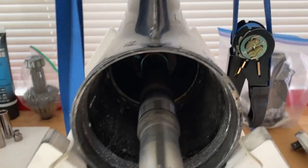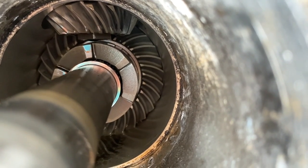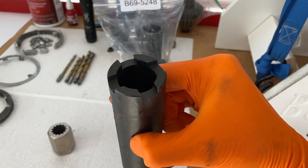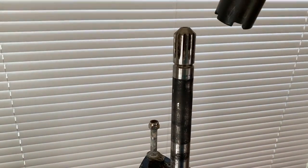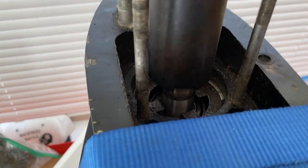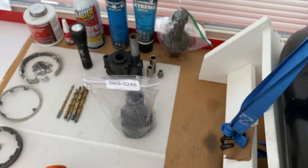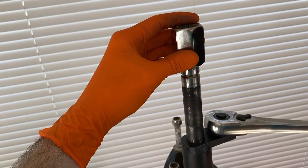I've got the parts unpackaged. You can see the upper pinion gear and nut — the propeller shaft feeding through the clutch dog and then that gear. As I spin this, nothing's moving, so it is now safe to continue. We'll grab the retainer wrench — it's got a half-inch connection for a ratchet. We are going to carefully shift this up and slide it over the drive shaft and all the way down to the retainer nut and align it properly. Then I'll grab the adapter and carefully align the splines and shift it onto the drive shaft splines.